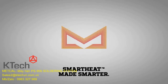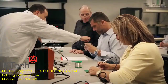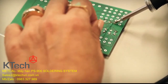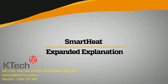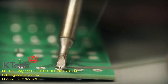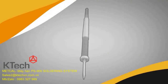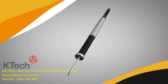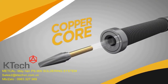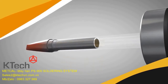To meet the industry requirements and mitigate the risk associated with hand soldering, it is necessary to modify the operator's approach to the soldering process. Metcal's new approach closes the loop on hand soldering by introducing exciting new technology into the electronics manufacturing industry. The Metcal cartridge is made of a heater of proprietary design consisting of a non-heating copper core and an outer heating layer of magnetic alloy. The composition of the alloy predetermines the tip temperature.